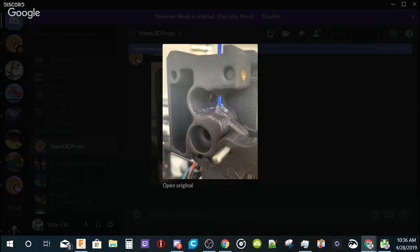But yeah, I'd send a... Where's my mouse? Can we see my mouse? No, I'll have to go up here. Yeah, I'd send a heat gun in, or a hairdryer right in here. One moment. You know what I mean? Send a heat gun right into this area or a hair dryer, up the inside of this area to make it larger. So you ain't getting the filament heated up just in here. I mean, that's just what I would try to do. He's gonna measure the filament right now. Yeah.